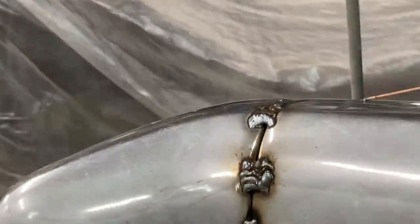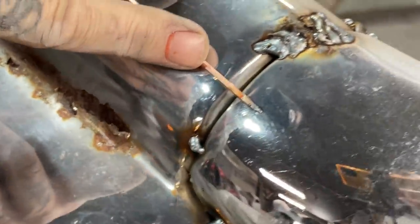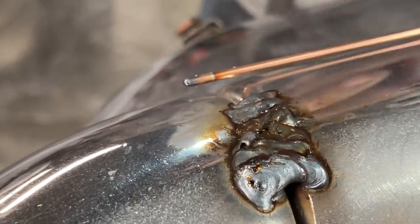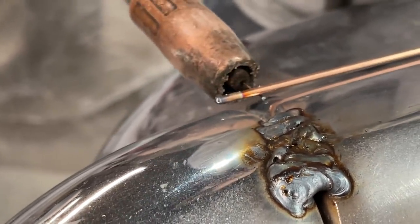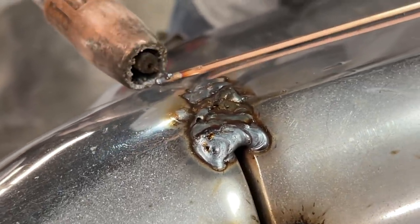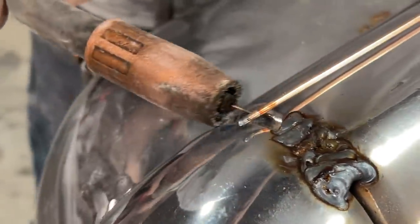Come over here and see, look. I'm going to take this piece, laid flat. Not bad. So basically, when you look down through there, can you look down through the hole where the rod's sitting? You can see that there's an area right here that needs material. When I hold that down flat, there's an area on that side that needs material. So that's where I'm going to put my material in here. That's what I'm looking for.